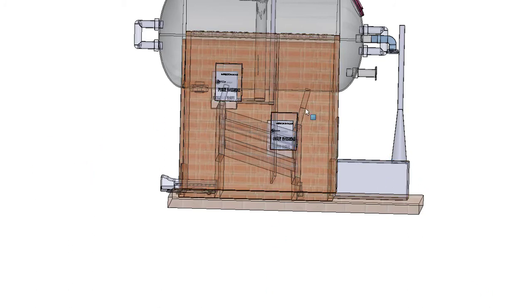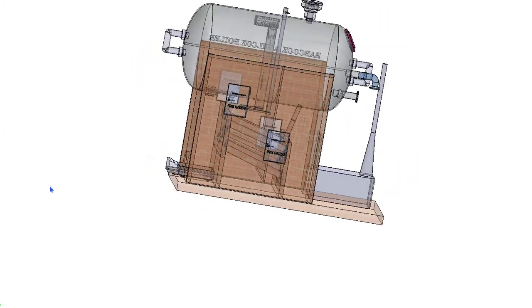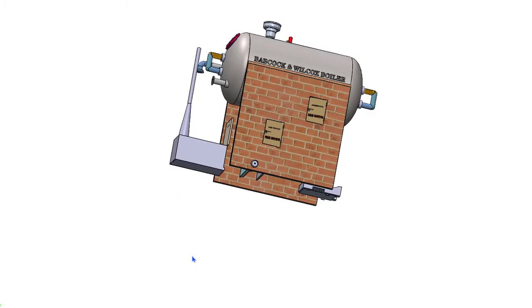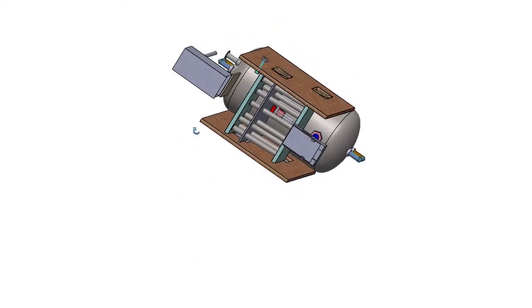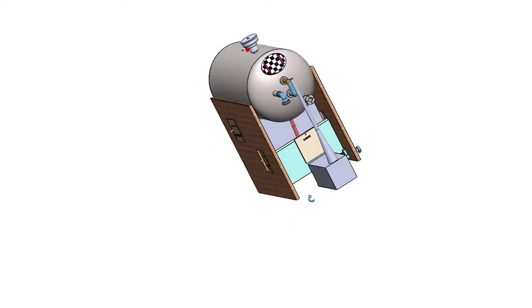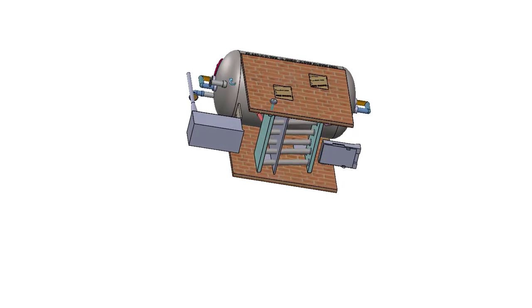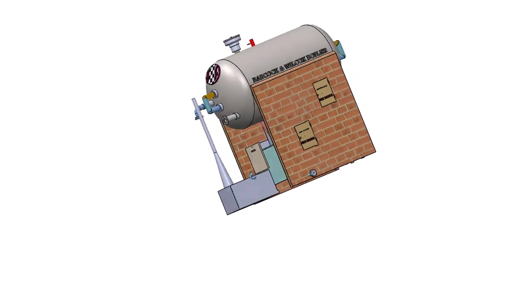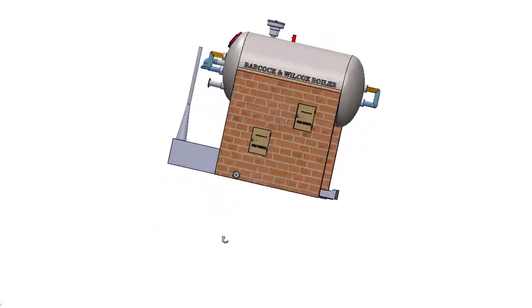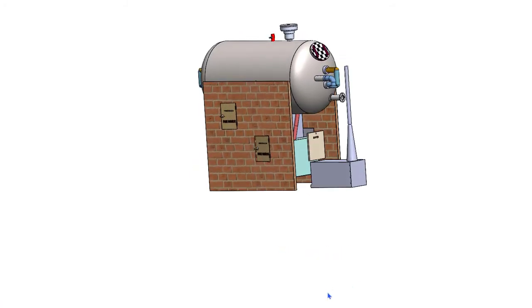The downtake header is occupied by the water coming down from the steam drum or water drum. In this way, the convective current is established. In this transparent view, you can also see the locations of the parts: long pipe, short pipe, fusible plug, uptake header, downtake header, baffle plates, the damper, and all the parts inside the refractory wall.